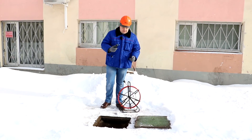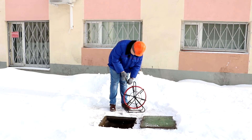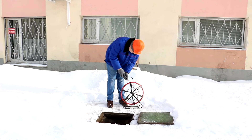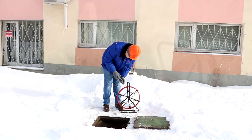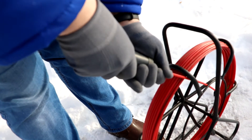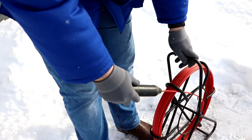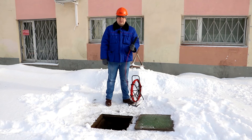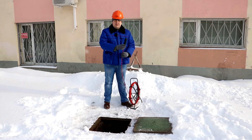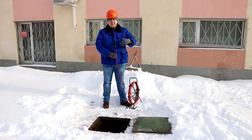We are placing the transmitter on the barrel like this. Make sure that you place it as tight as possible when you have mounted the pipe transmitter on the pushing rod. After that we have to place it in the manhole and inside the pipe.